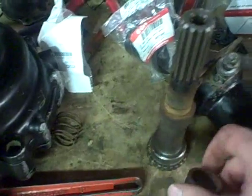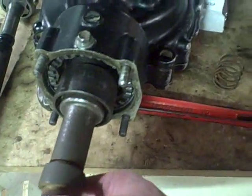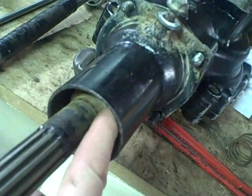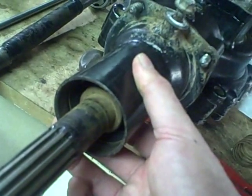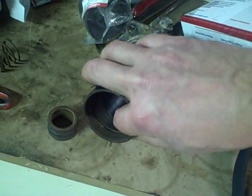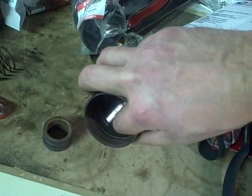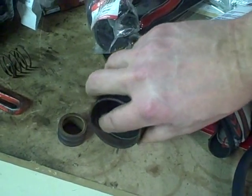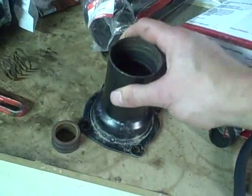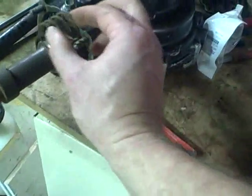When you take this stuff off and insert the shaft in here, then just temporarily put the housing on, you can see that that collar — that I don't even think belongs there — is actually about in the position where the bearing should be. The way I know that is because there's a very distinct area right here that the bearing sits in. Basically the bearing gets pushed in and bottoms out on this little lip, and then there's a retaining ring that goes in there and retains it. So that's why I believe this spring belongs between here and here.